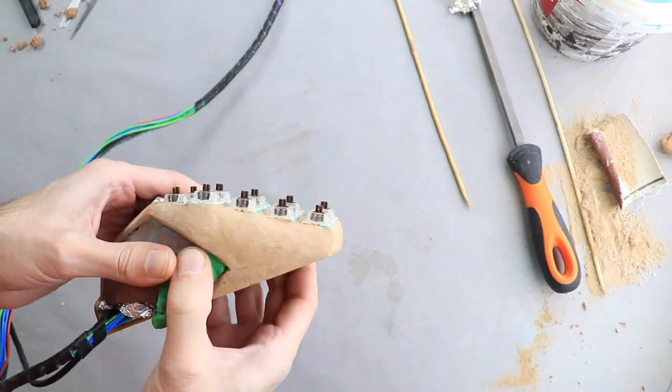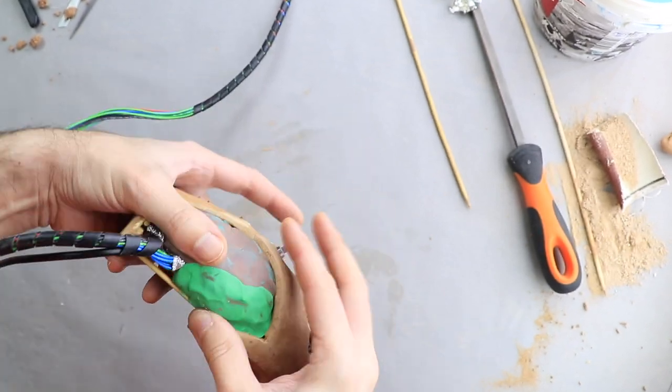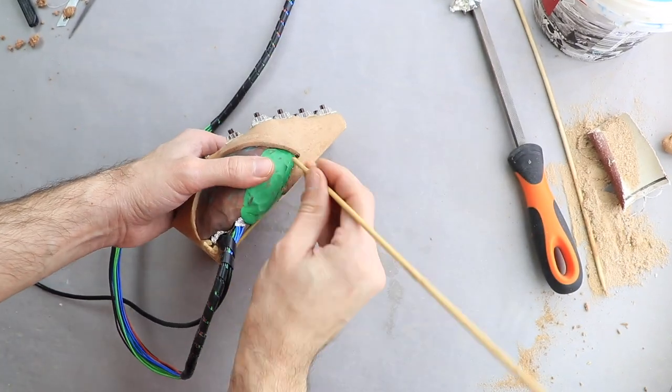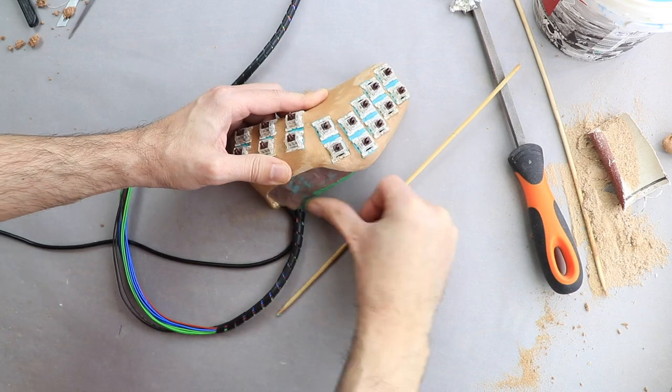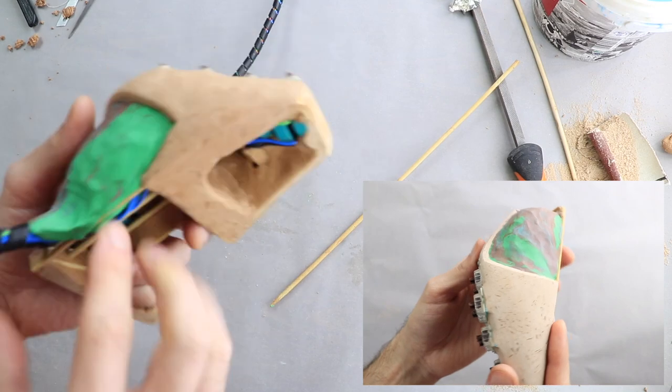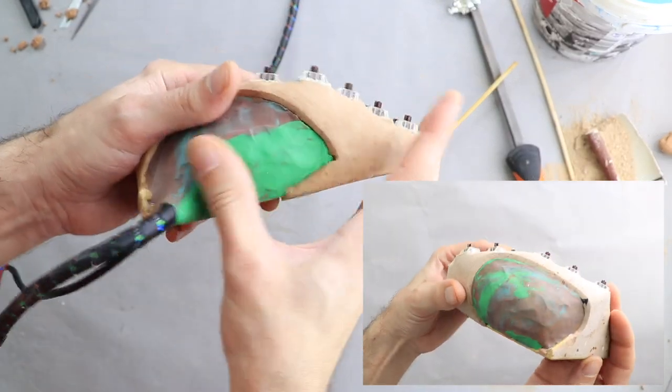When I'm doing this, I have to make sure that the lid will be thick enough in order for it not to break. And if with plastic cases the thickness of the parts are from 1.5 to 3 mm depending on the application, that is not the case with the clay I'm using as it has different properties. And just to be sure, I went with about 5 mm.